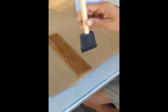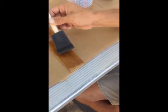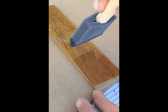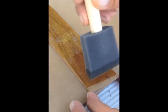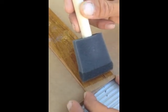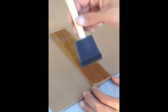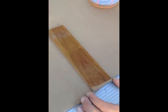And brushing back, if you brush from the wet edge, I don't know if you can see it, that buildup right there. You can see that little buildup line. Zoom in a little bit here. Yeah. Okay. I think I can see that. There's some ripples across the surface here. Correct. When you go from a wet edge to dry, that's what happens. That's why you go from your dry back to the wet edge. You don't get that. And so you eliminate those ripples. You eliminate that ridge.